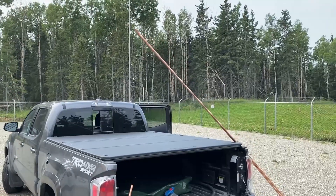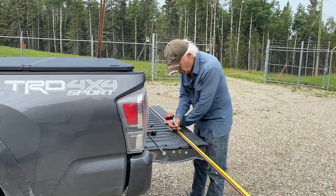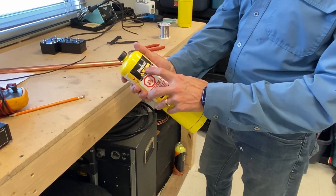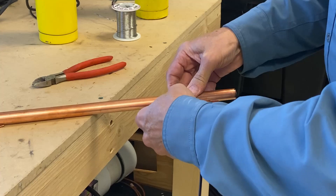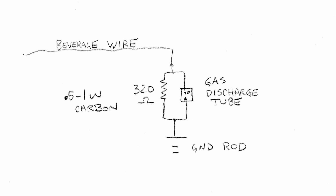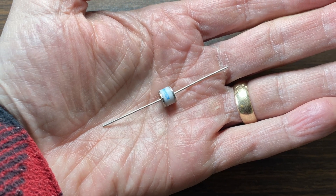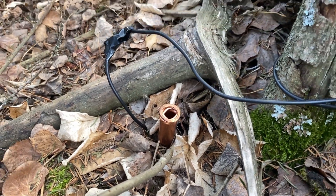For the termination and feed point grounds, I use half-inch water pipe. Home centers sell 12-foot lengths. For the termination, I cut four three-footers, and for the feed point, I cut three four-footers. I use a MAPP torch to solder the connecting wire to the pipe. Buy one of these self-starting types — don't even bother using a regular propane torch. The wire is terminated with a 320-ohm resistor — just a small 1-watt carbon comp type. I now solder a gas discharge tube across the resistor and solder it directly between the wire and the ground rod. A bit of black tape and I hide it under a log.